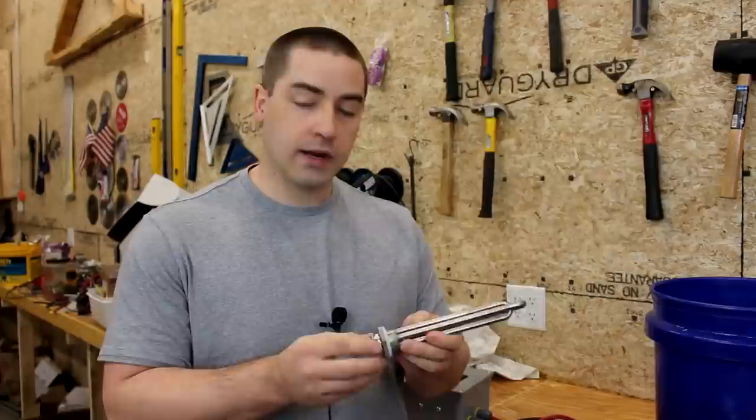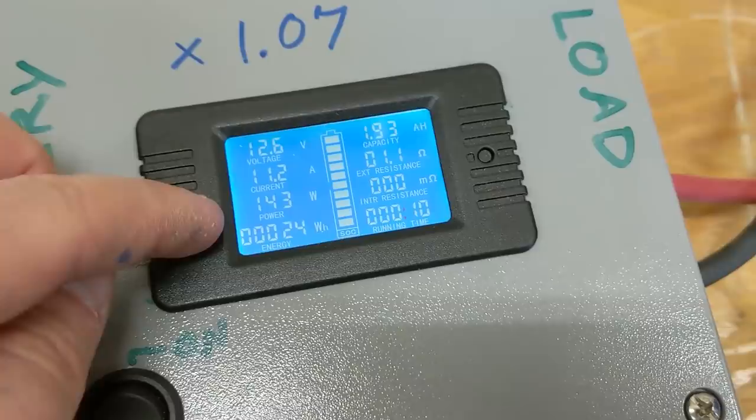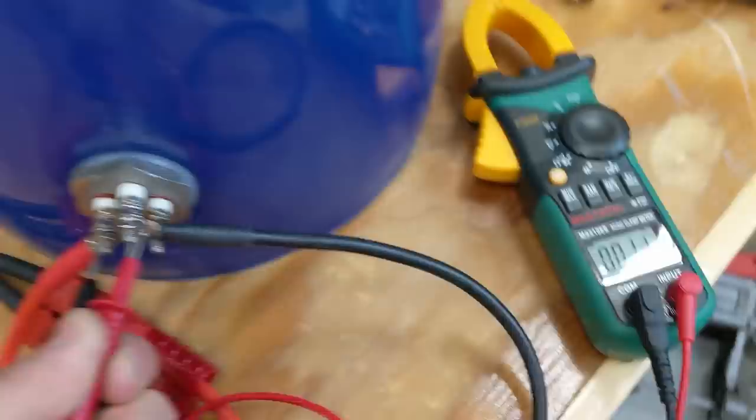I don't want to speculate what happened, but I didn't receive the product that I ordered, so I will be returning both of the heating elements. It's been running for about 10 minutes and we're a little bit lower in total wattage. The circuit breaker is off so we're not drawing anything, and you can see we are at 1.1 ohms — both elements are identical between this one and the one in the vise.